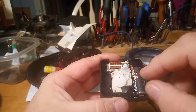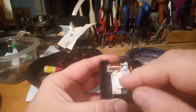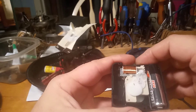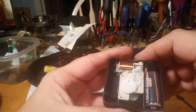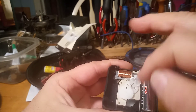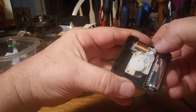I had to take parts off the old movement to put into this movement. I highly suggest, if you ever work on one of these, put little dots on every one of these gears so you can see whether or not each one is working properly.